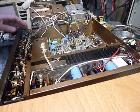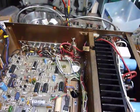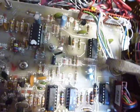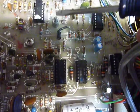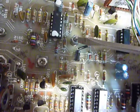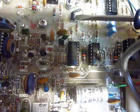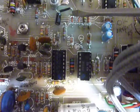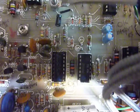I wanted to show you a couple of modifications that I think are worthwhile making. The first one is to extend the CW dropout time. I put a ground lug right there on that 6-32 bolt — there was enough room to put another nut — and I put a small capacitor of 2.2 microfarads. The positive wire comes over and just wraps on that first little diode; I made a little tiny U-shaped wrap and closed it with long-nose pliers and soldered it on, then soldered the ground side here.